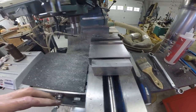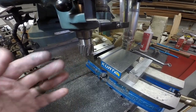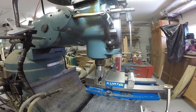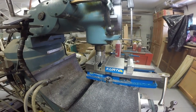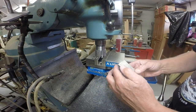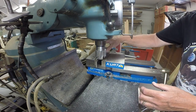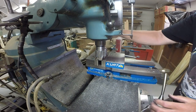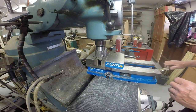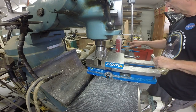So we'll do that. I've got a nice high-speed steel shell mill here. And this is very sharp. I mean, it's almost new, and it does a great job with aluminum. So let's go ahead and square up this aluminum block. All right, of the faces on this, this one was bandsawed freehand, so it's a little off. This is probably the straightest, so we'll start there. These two surfaces here are both mill flat surfaces. The dimensions on this are not critical. We'll see where this gets us.